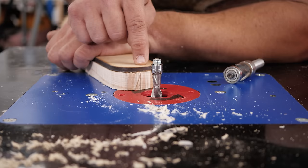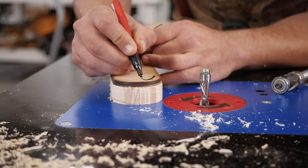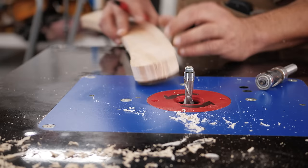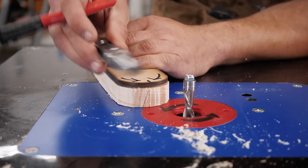You always want to work your way up to it and work your way around. For a curve that has an apex on it, you would want to cut this way and stop in the middle at the apex of the curve, then come the other way — flip the piece over and go the other way to the center of the curve. That may involve changing to a different router bit or switching which bearing you're cutting off of.